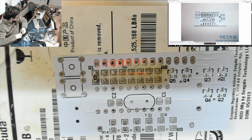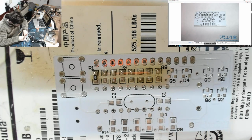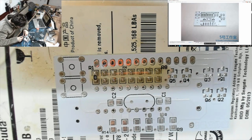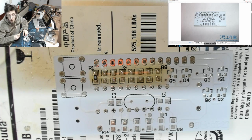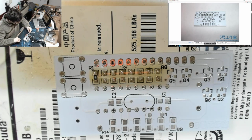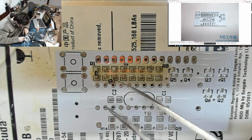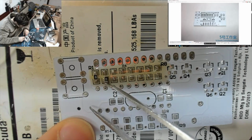These resistors are slightly undersized, so we'll now go ahead and flux at maximum, and we'll just put a load of these on. Okay. Need to be super careful not to actually lose all of these, because if I slip with this guy, it's all over. They have given me 2 spares though. Just pouring a load out onto the mat. And of course they're all upside down. It doesn't matter if they're upside down, but for tidiness, we'd like them to be the right way up.